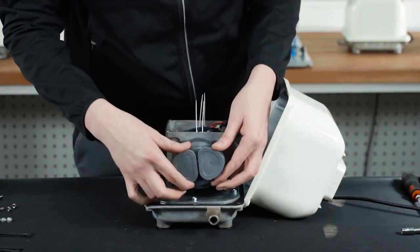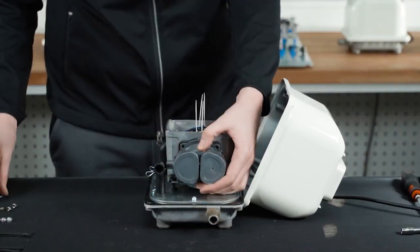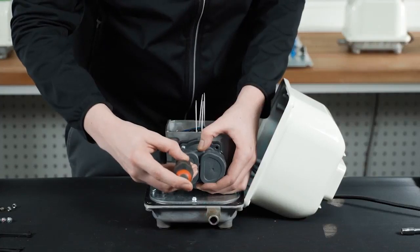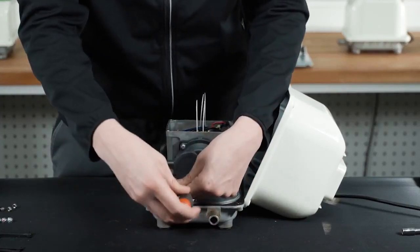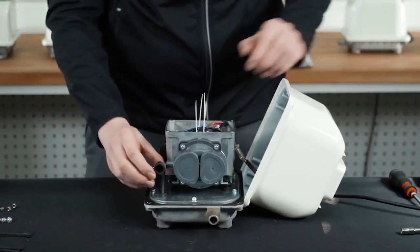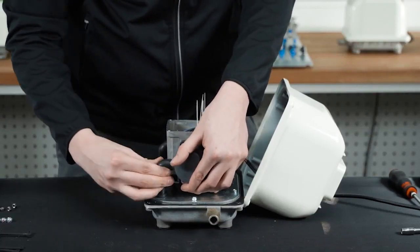In the further course of the airflow or when connecting the peripheral devices — air hose, valve blocks, aerators, etc. — it must be ensured that the sum of the resulting pressure losses due to cross section reduction, opening pressure, and maximum water column at no time exceeds the permissible maximum back pressure of the compressor. The resulting damages cannot be claimed as warranty.